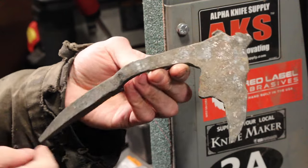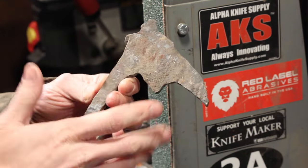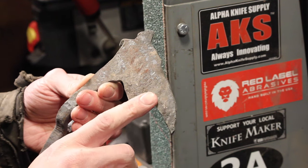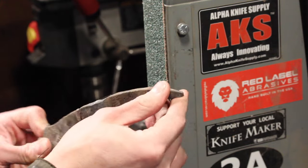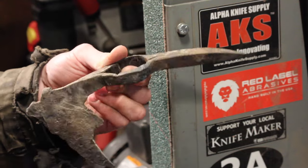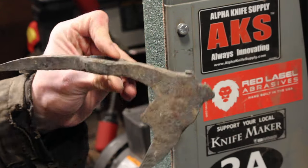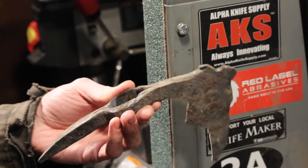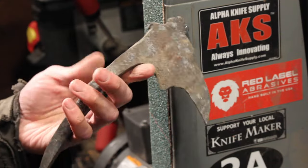Here's what the spike hawk is looking like. You can see that's the high carbon insert right there. I've got a little screwed up spot - not a big deal, I'm going to grind that out. Since this is the carbon steel insert, I'm actually going to put a secondary edge in here, so we have two cutting edges - kind of to be a specialty fighting tomahawk, obviously with the spike on there. I think it's kind of cool, I like this shape. It kind of reminds me of a boarding axe, like a pirate boarding axe. Just going to roll with it - it's my first time doing this type of weld, and as I always do on my YouTube channel, I show you my first time trying something. It's always going to come out the worst, so my second one I'm sure will be much nicer. Let's do some grinding and see how she cleans up.